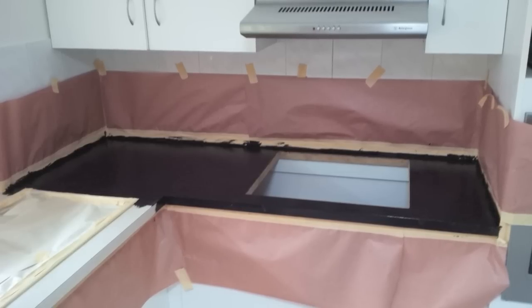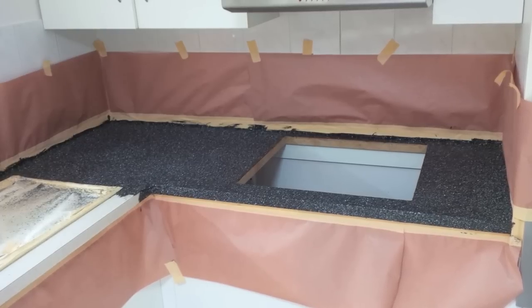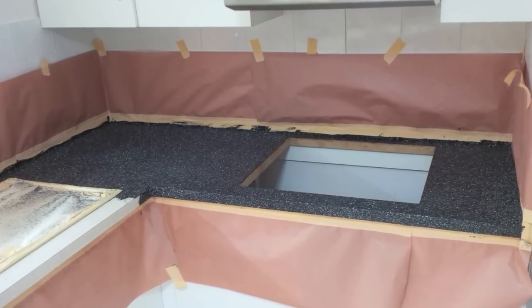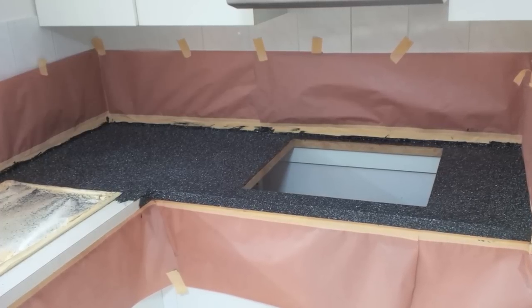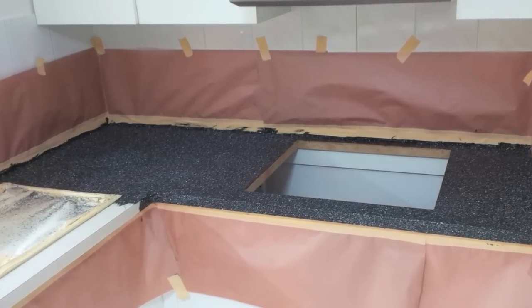I'm getting a nice heavy coat right into that taped edge and I'm about to put the fleck on top of this. Here you can see you get a little machine with this kit — you basically pour the fleck in the top, wind a little handle, and it spews it out everywhere over the job. The best way to do this is to do the edges first and make sure you get the edges covered.